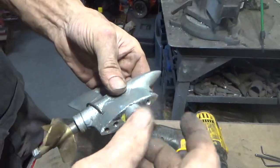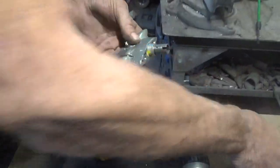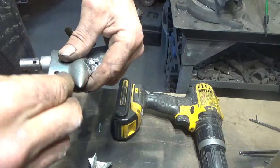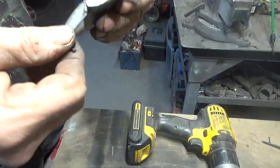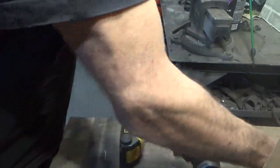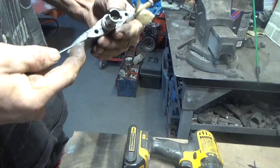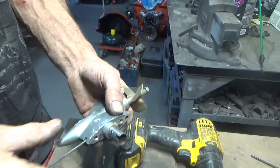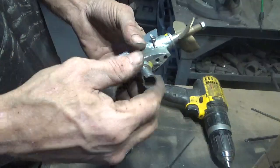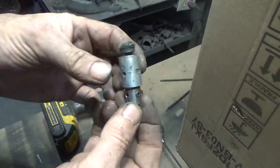So basically, what the gears are, we'll take them out. I'll show you. I've got set screws in different places. I know I got the right Allen key here. There we go. So basically what I did is I made barrels, aluminum barrels, with a bearing in each end of it to hold the gear.